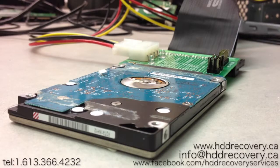We'll talk about those things in further videos, but today's quick video I want to dedicate to Toshiba's unique issue, and that issue is associated with the bearing of the drive. These drives use fluid dynamic bearings, and the downfall of the Toshiba drive in a certain era started happening because of that failure. It was so common that almost every hard drive that would come in at a certain point had issues when trying to rotate.